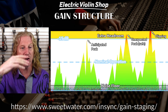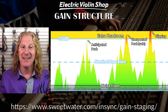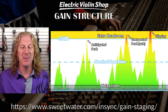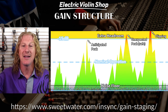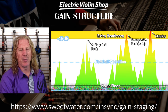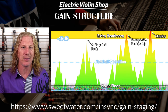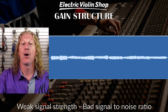Nominal is kind of in the middle of where that circuit size is. Fortissimo is up around minus 15 dB, and on a digital circuit, that's kind of where we want our expected peaks to be. Sometimes if you get in front of a crowd, you may play a little louder than you did during a sound check — that would be an unexpected peak, and that's still safe, we're in the yellow area. And if you slam your bow into the thing or somebody bumps it, that would be an extreme unexpected peak. If it's clipping in that situation, we're okay with that because that's not something we really expect to happen. This is what good gain structure looks like on any given circuit.